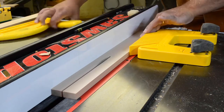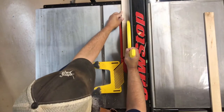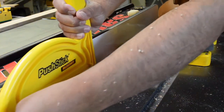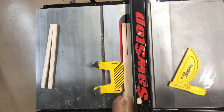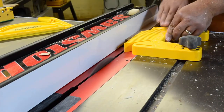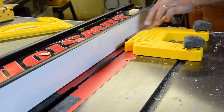To prep the maple wrap, I have readjusted the rip fence, added a feather board, and rip the pieces to slightly larger than their finished width, starting first with one of the end pieces, then moving on to the first of the long strips. After the first two strips are cut, we then readjust the feather board for the much narrower remaining strips, and then cut those pieces to their final dimension.